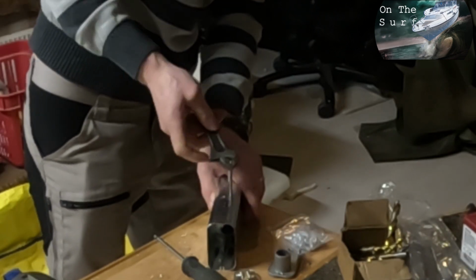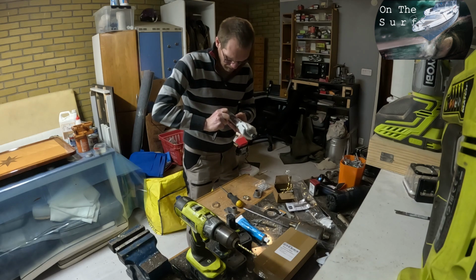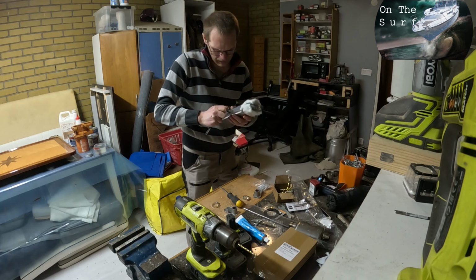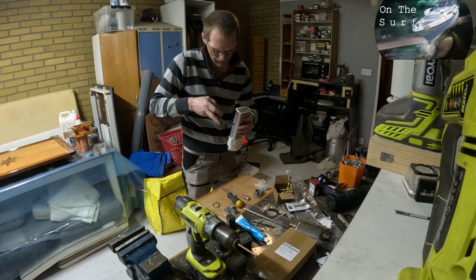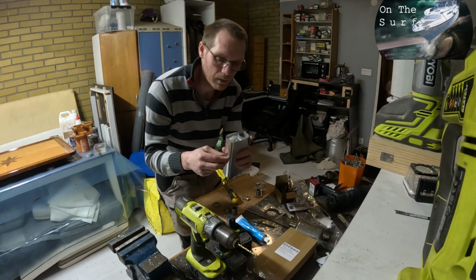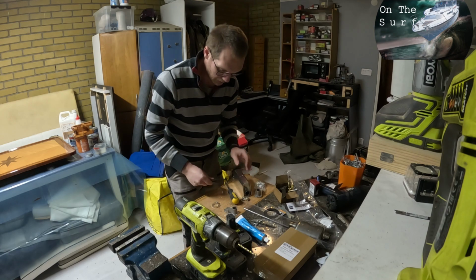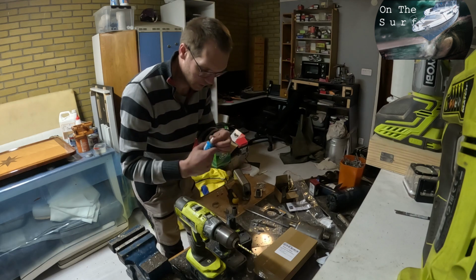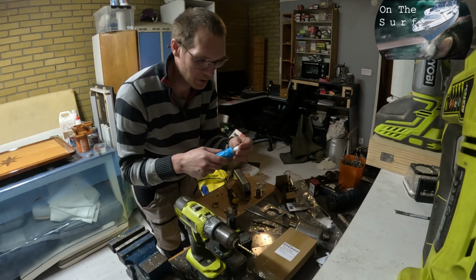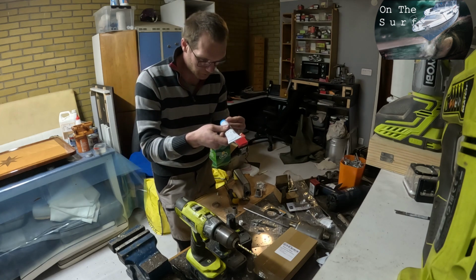Thread the holes. And since the silencer is made of aluminium, I've ordered aluminium bolts. And as usual, links are down below in the video description. Here I have some mounting paste for exhaust system. So just apply a little bit on the threads.